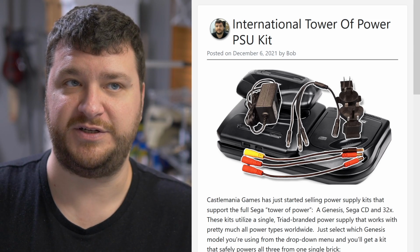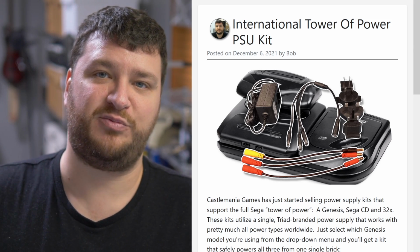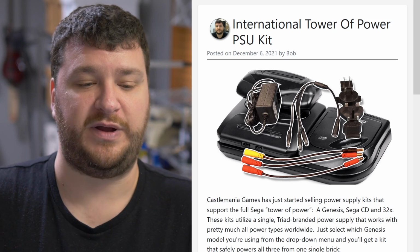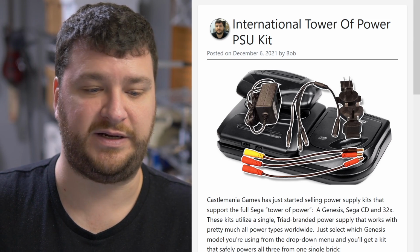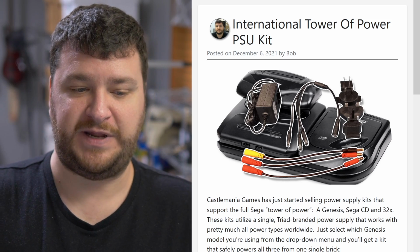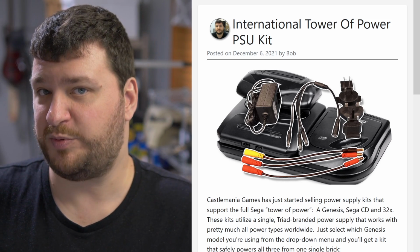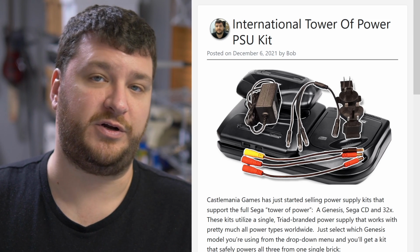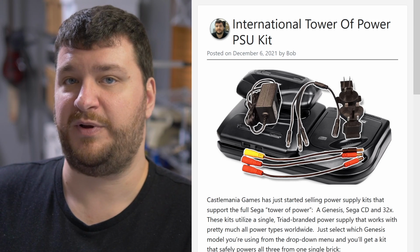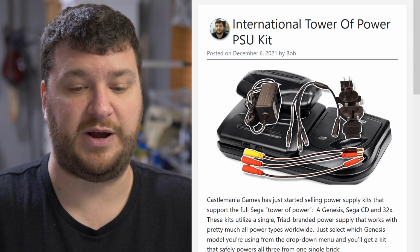Because unlike voltage, and I know this is a weird analogy, but I think this is a good one, amperage isn't sent down the lines. It's there if you need it. So if the total tower of power needed 1 amp, I'm sure it needs more, I'm just making that up for an example, but if the tower of power needs 1 amp and you had a 1 amp PSU, you should probably be fine. Anything lower and it could cause issues. But if you used a 2 amp, a 10 amp, a million amp, it's just there should the consoles need it. It's not sending that extra power down.